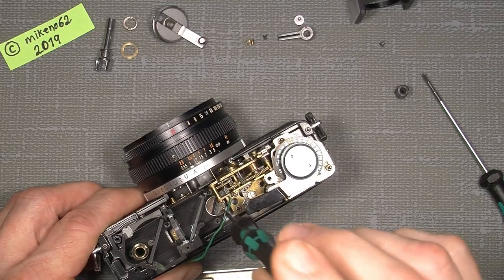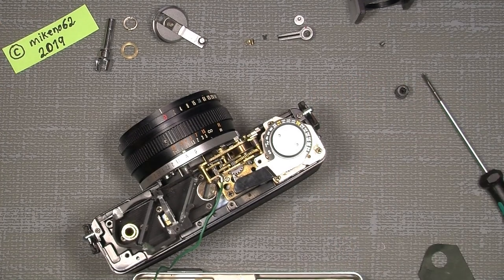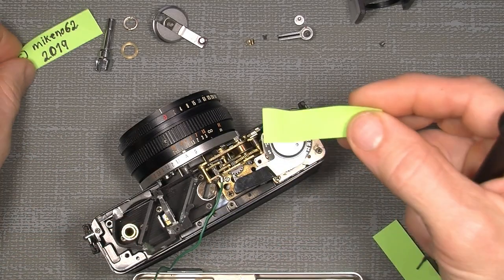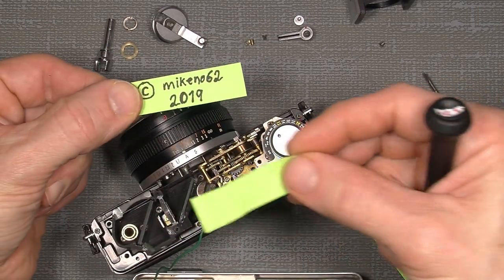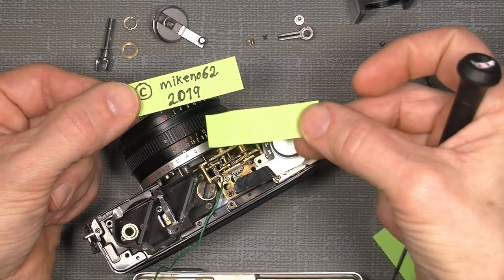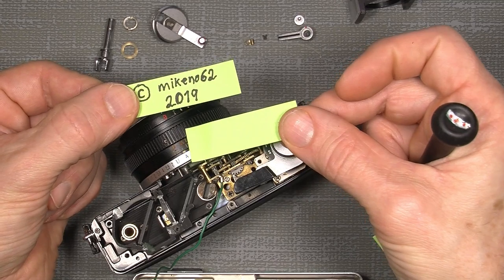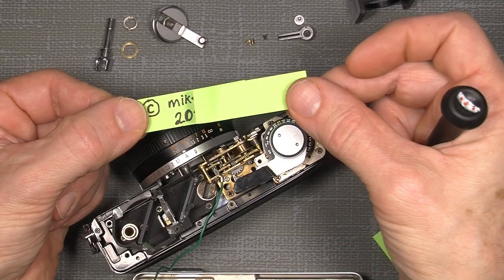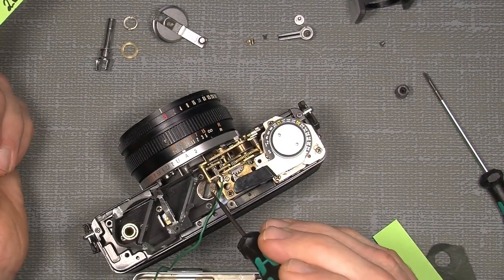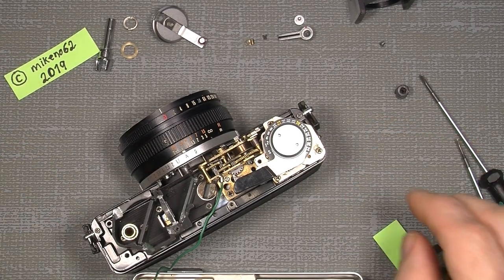So simply turn the, let's say the superimposed picture, let's see if I can do something here. Well, I will show it anyway. But this is the correct focus. This is the superimposed. So if I want to adjust the vertical alignment, I simply turn the screw here clockwise. So the superimposed picture will come up to here, as it should be when it's correct. If it goes over, well, you just need to screw this counterclockwise. So simply take the picture down. But let's see how this actually works in the next film clip.